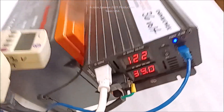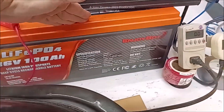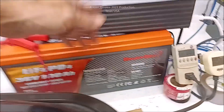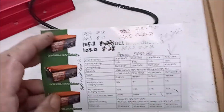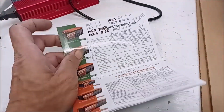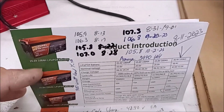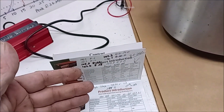EnjoyBot comes in every variation you can imagine. You can put up to six of these 36-volt batteries together — your whole home can run off this. We're pulling a constant non-stop 70–71 amps, and the voltage is still sitting at 38.4 — that's just nuts. We've got this boiling and this baking: 1400 watts, 1000 watts off a 3000-watt inverter. All the other inverters give you 108 to 112 volts output; this gives you 121 volts, genuine household voltage.